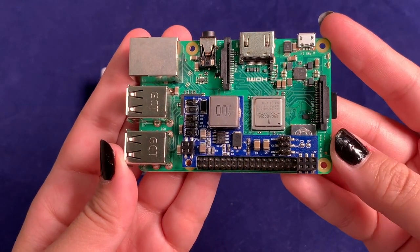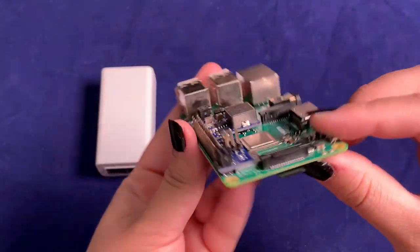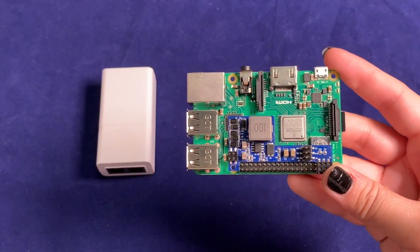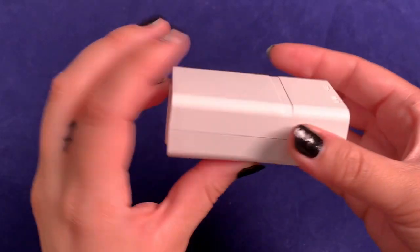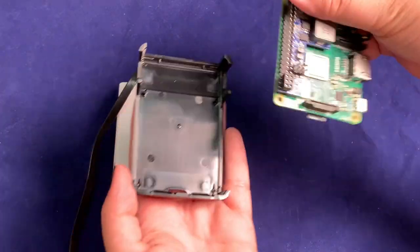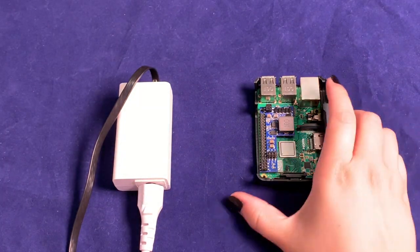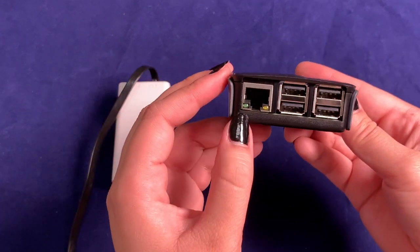The power input for this splitter is supported on mode B for pins 4, 5, 7, and 8, and also passes through up to gigabit data rate. The PoE Pi hat comes with a heatsink as well. The PT GPOE-1B 48-volt 15-watt will be our passive mode B injector option for this demonstration. The PoE Pi hat will also fit securely inside the official Raspberry Pi case.